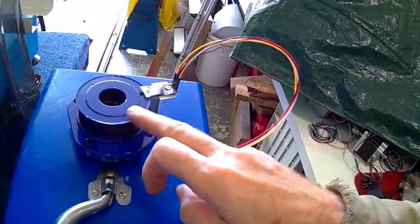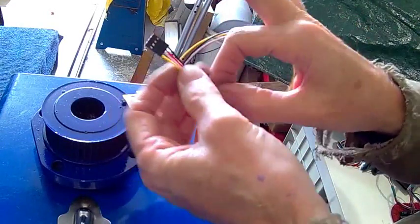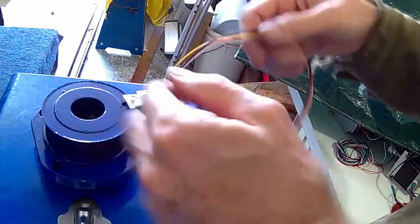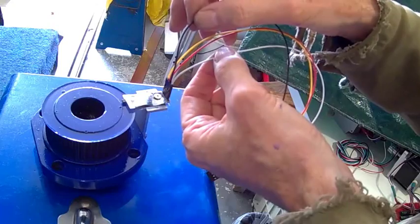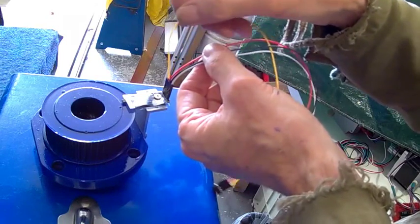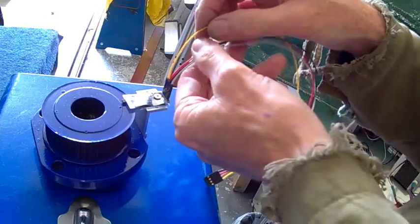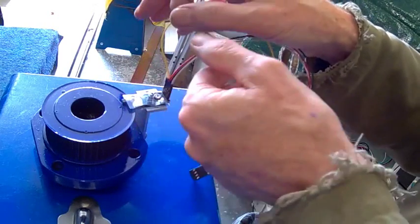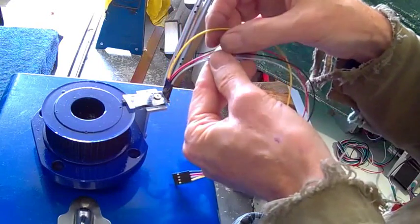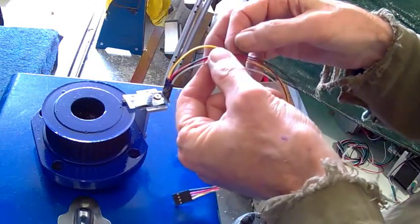It's all nicely finished, painted, and assembled with a Du-Pont connector. I've adjusted the wiring from the standard eBay colors to match the actual terminals: positive voltage is red, negative ground is black. I always use yellow for signal wires, so when looking at wiring at the back of the cabinet, yellow means signal. For X, Y, and Z axes I add blue, red, or green heat shrink respectively. The analog output uses white.